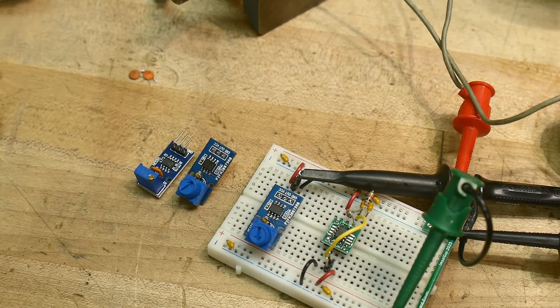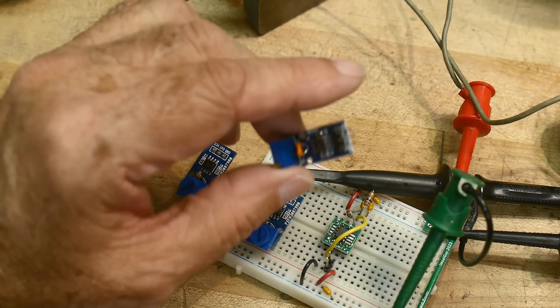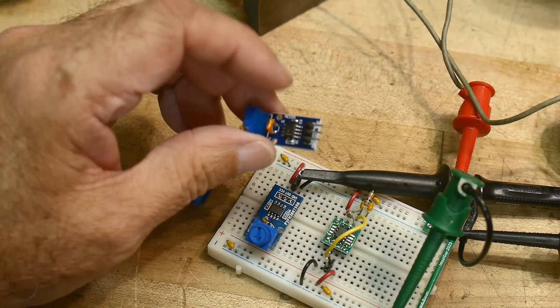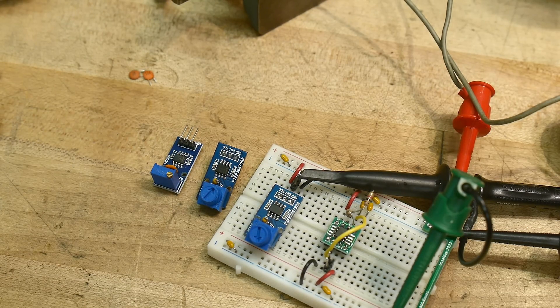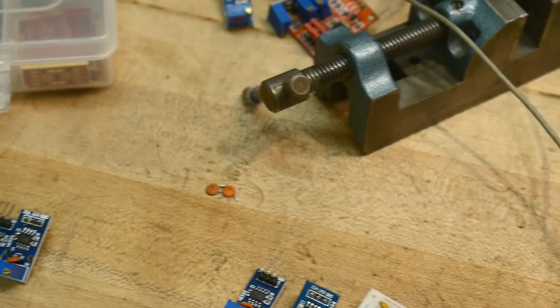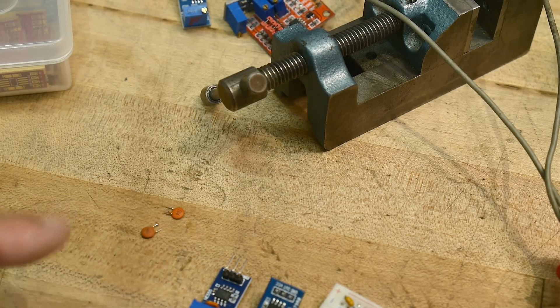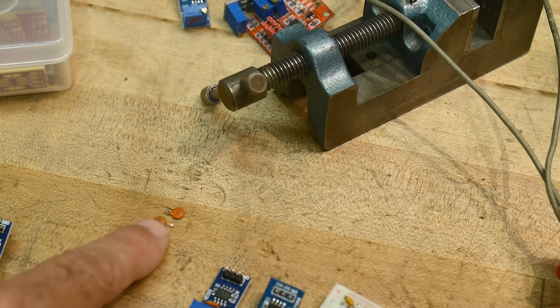You might say, 'Wait a minute — it was a 104 and you replaced it with a 103; of course that fixed it — you were out of range.' So I replaced it with a 0.1 µF cap that actually measures 100 nanofarads — and it works great. So it was the capacitors themselves. The capacitance is a function of the voltage you put on them to a huge extent. I've never seen it before — comment below if you've seen this before. The only thing wrong was just really, really cheesy caps.